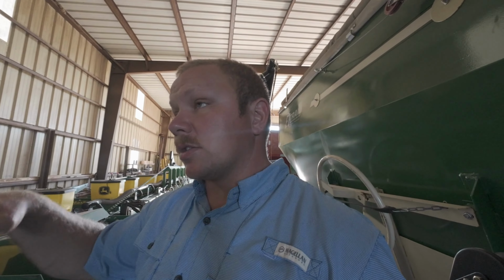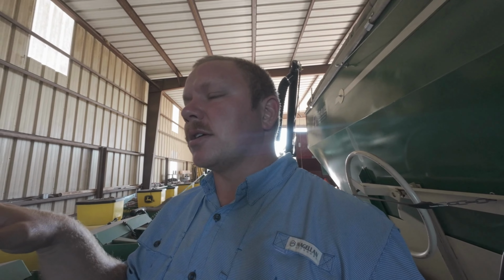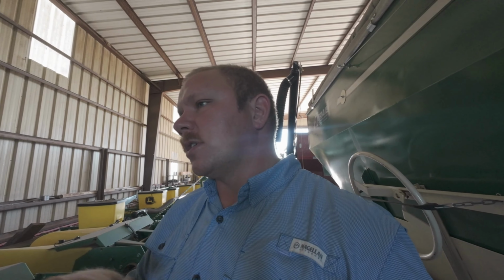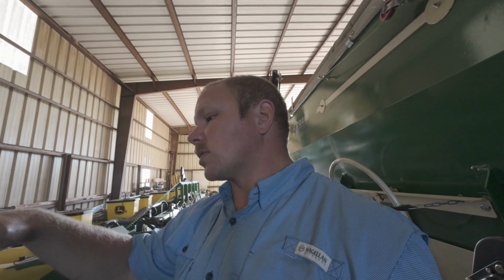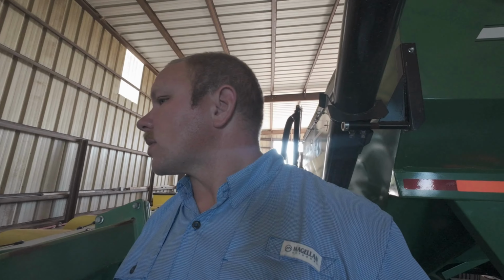I'm hoping that I'm not going to need to put those back on, because there's a pin in that cylinder that you've seen me do on the other stripper. I need to get that pin out so that we can take these row units off or slide them easier. And I couldn't do that, it's under pressure. The cylinder pin is tight. And so I think that's what I did after I said bye to you. And so now I'm back.